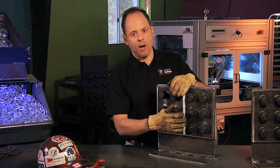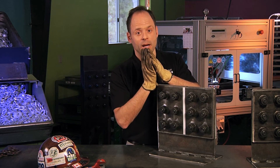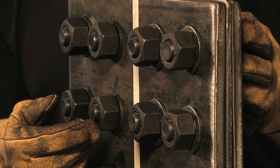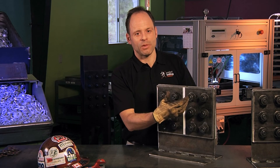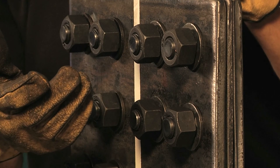Now all the bolts are stuffed. We can snug the connection from the middle outward, bringing our plies into firm contact. After that, we can tension all the bolts. Somebody's going to turn the bolt head, somebody's going to keep the nut from rolling. When you see the bumps flatten out, or the proper amount of silicone come out, we're going to stop tightening.